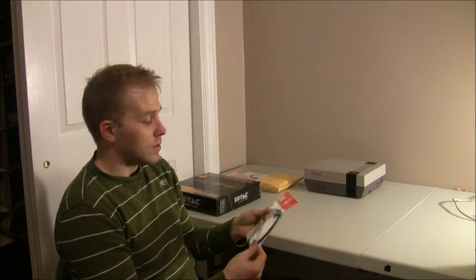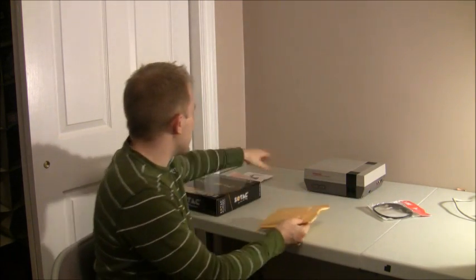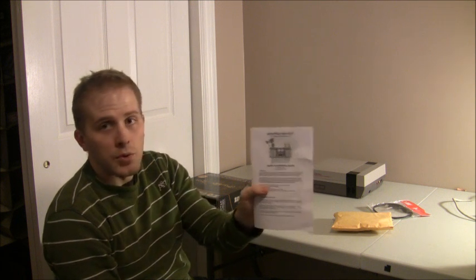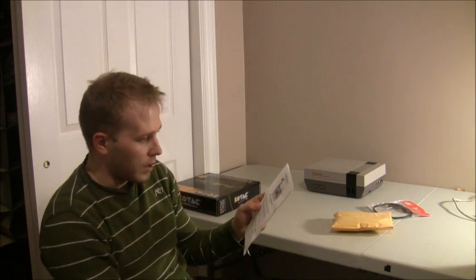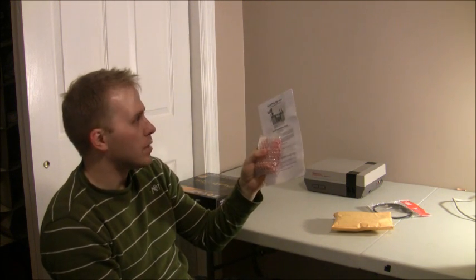Here are the parts I'm going to use to get HDMI sorted out. I've also got the Pico PSU 90 XLP — XLP stands for extra low power. This is the newest green version of the Pico PSU, which is already very efficient. It's a very small power supply, as you can see here in the package — incredibly small. You've probably seen these used in other small builds. This is the 90-watt Pico PSU 90 XLP.